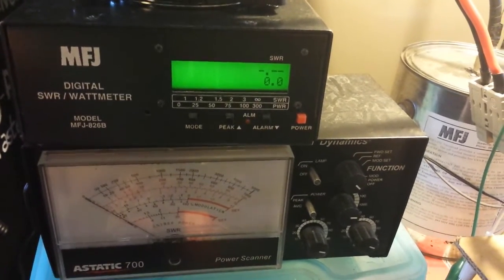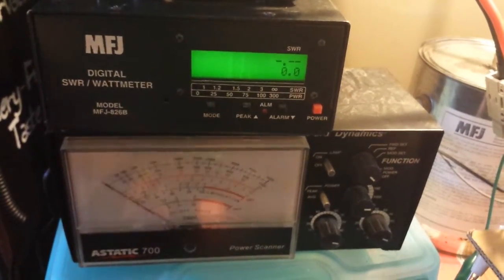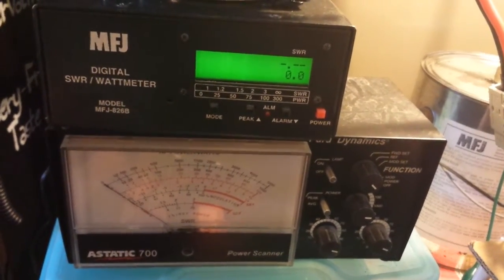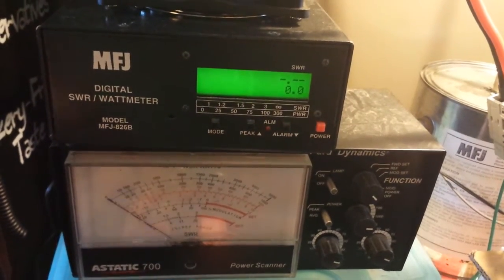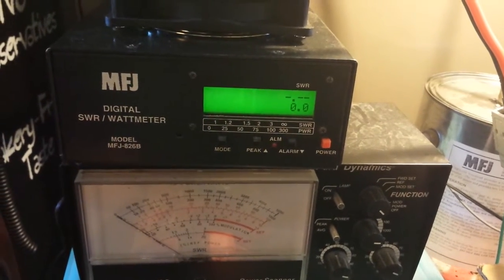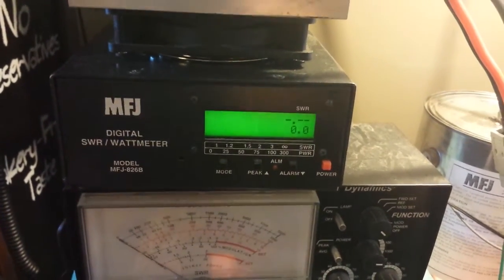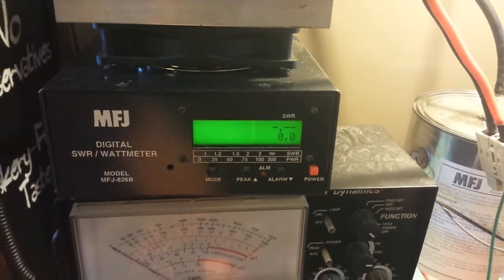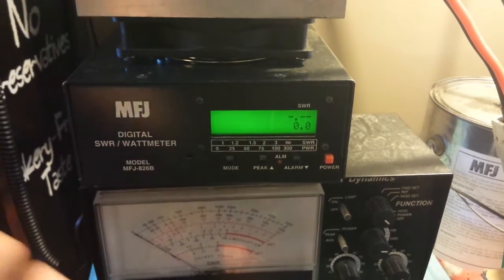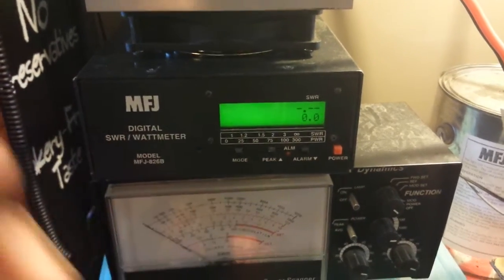The dB gain table, you've got to understand it in your mind, man. You've got to double your wattage to have a noticeable increase on the other end. So if you're doing 800 watts and you've got to really squeeze 200 more watts out to get it to a grand, and you've got to squeeze watts as in do something crazy to generate just more heat and strain, it ain't worth it, man. Because you're gonna see 1,000 watts on this end, but the person on the other end ain't gonna hear no difference. If anything, they might actually hear a little bit more distortion if you winding that Class C box out. That's just the way it rolls.